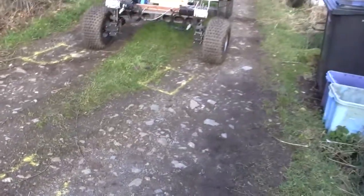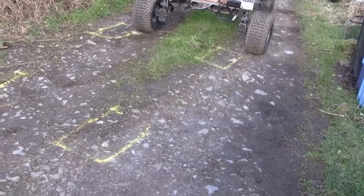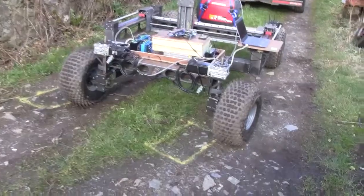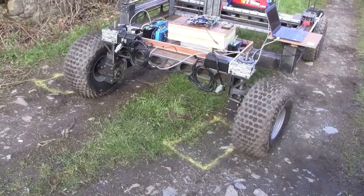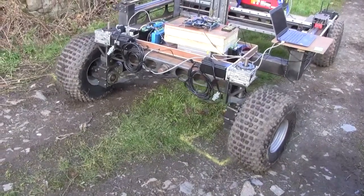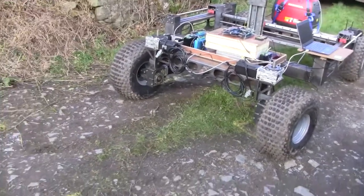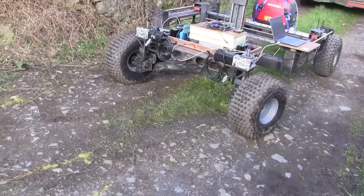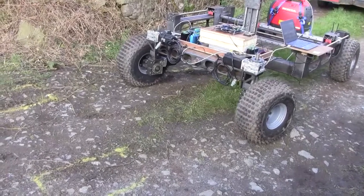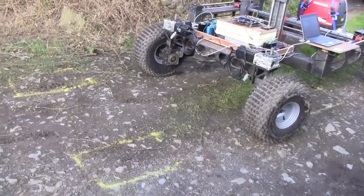So here comes the machine. Will it manage to navigate to the first waymarker? I can hear the motors on the steering — they sound a bit like a horn. It's kind of a twin tone noise because one wheel drives faster than the other when it's steering — that's obviously differential steering. If the wheels turned at the same speed, they would grind on the surface and put a lot of strain on the steering, so the steering itself relies on the power of the wheels to actually assist it — it's kind of wheel-assisted steering.